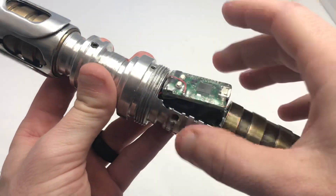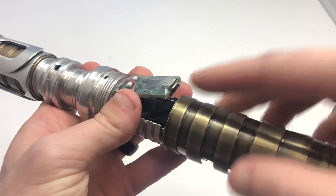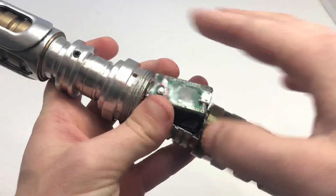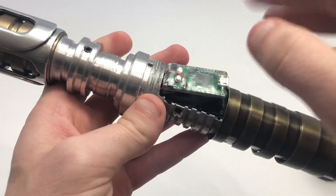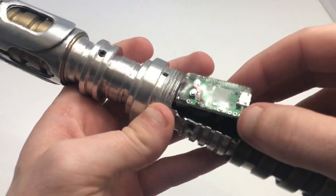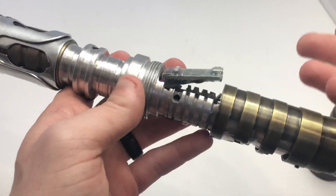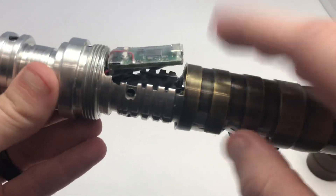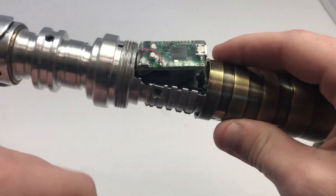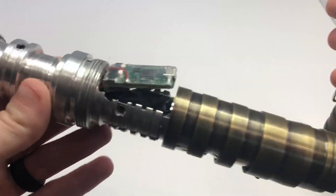The cables are pretty safe — as long as you're not yanking this out, you're not going to have any problems. I have them routed down in a channel down here. Just lift it up a little bit and you have access to both the SD card and the USB port. The entire board, as you can see, is heat shrunk, so there will be no shorting of the board. I also have a little bit of extra black electrical tape on here just to further isolate the already self-isolated recharge port so that there's no accidental shortages whatsoever. The battery is hardwired — there was absolutely no way to make a quick disconnect or use contacts in there, simply no room for it.